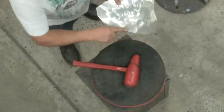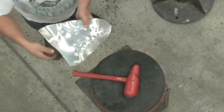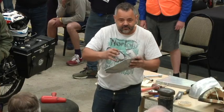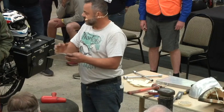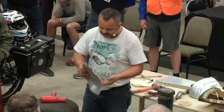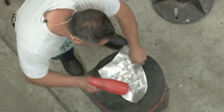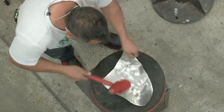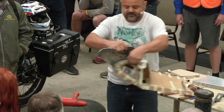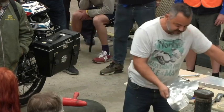Now you'll notice it's puckering up. That's the material saying, I don't want to go where you want me to go. I don't want to shrink. Okay, so I've got to work those areas and bring that material in to allow the flat piece of metal to go around. Okay, so I'll go back to my reference. Okay, and I'll just keep trying to get it roughly into the shape I want. And then...